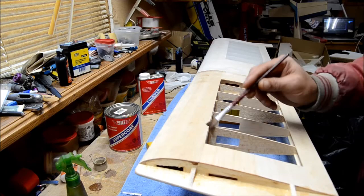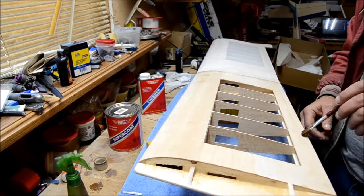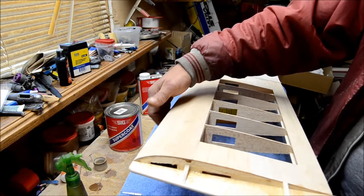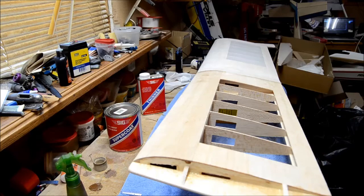The reason you're doing this — you're not going to cover the ribs or all this. You're just going to do the leading edges and trailing edges of everything. I usually do about a half inch up on the trailing edge, but I do cut it off on the trailing edge back here to where you're not going to see it and there's no place for your wingtips to grab hold of it. You also do the bottom first, that way when you do the top and lay your silk on, you can wrap it around the leading edge so there's no place for wind to start pulling it off.